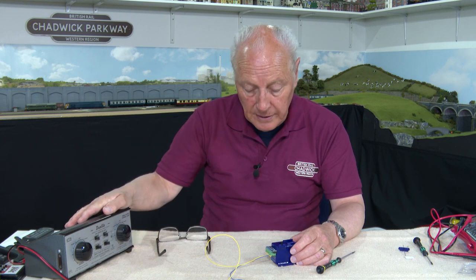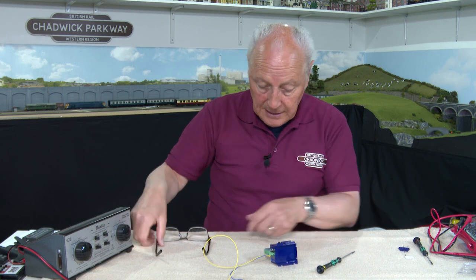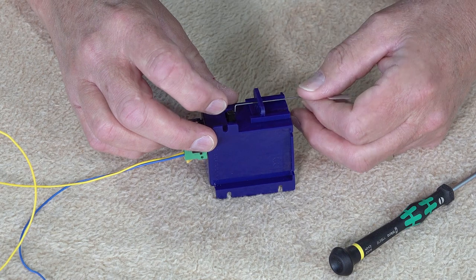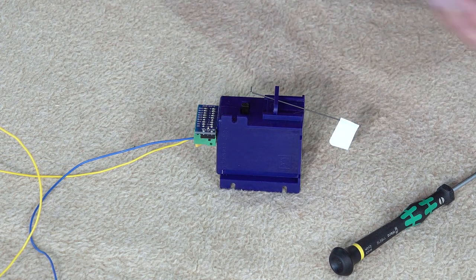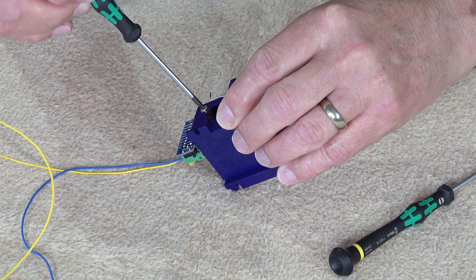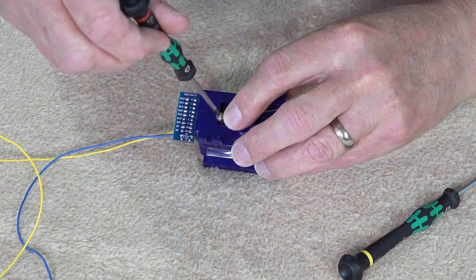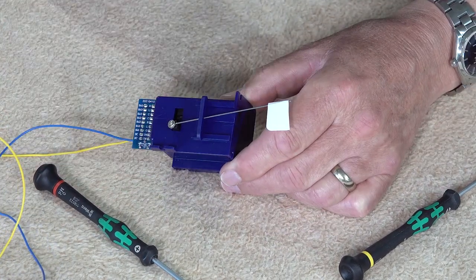I've connected it up to my old duet controller. If I turn it one way it will turn, and if I turn it the other way it should go the other way. To make that easier to see, I'll temporarily fit the armature wire — poke it in the little hole, it comes pre-bent which is quite useful. I put a little white tag on it so you can actually see it operate. So now if I apply 12 volts DC to it, it will run in one direction, and if I put it in the other direction the point will operate. You can feel the vibration coming through as the gearing system works and then de-energises when it hits its stop.